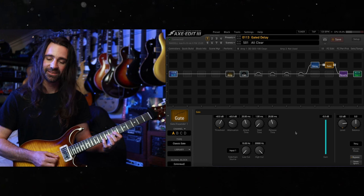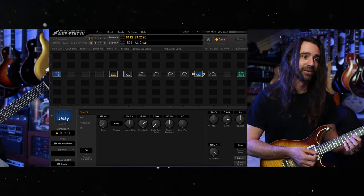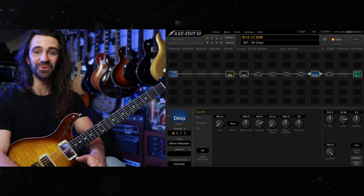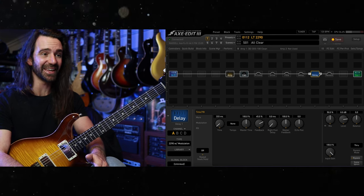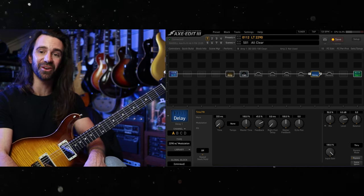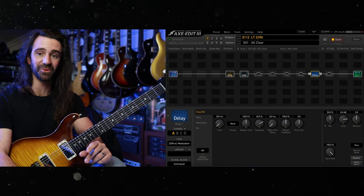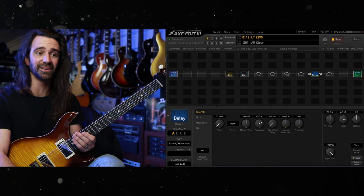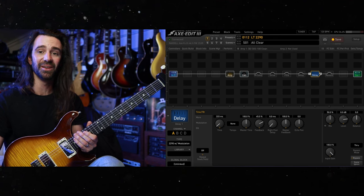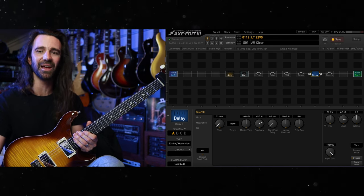All right, a totally non-awkward segue, but I did want to include this. I forgot to include it when I was shooting the video, and I've been sitting here editing it, and I got to this part and I went, I forgot to talk about the preamp and the frequency response of the rack. If you saw my 2290 pedal video, I did a comparison between the pedal and the rack with identical settings, and most people noticed that the rack was a little bit brighter. I have measured the frequency response of my rack unit, and it hypes the highs ever so slightly.